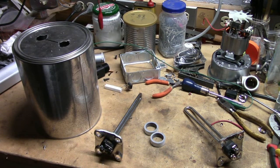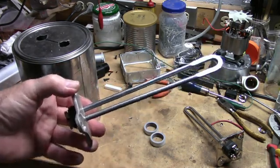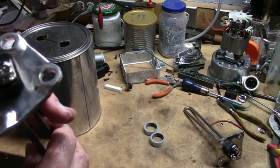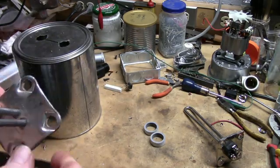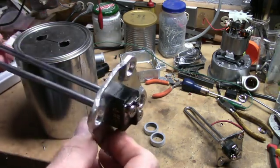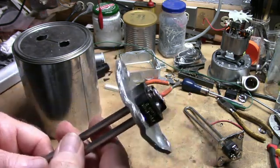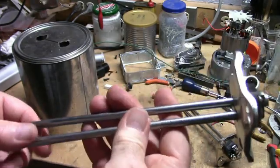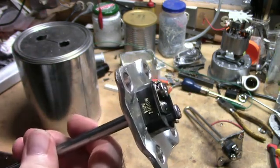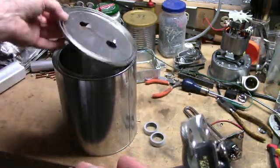What I'm using is resistive elements for water heaters — I've got two of them here. They're rated at 2,000 watts, and I measured the inductance and it's very small, like a microhenry. It's not much inductance at all, so this would make a good choice for a resistive element.